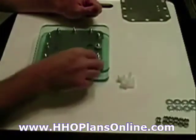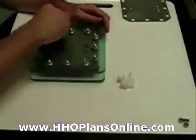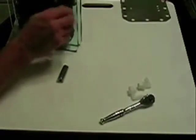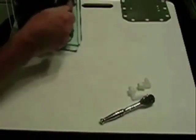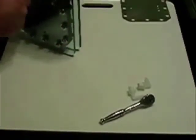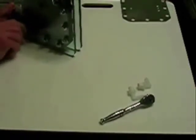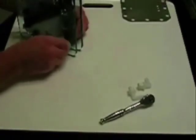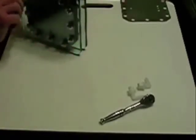Come back and put washers — you can use lock washers, but I'm using small fender washers for now. When you are torquing these — I'm just doing it hand tight right now — make sure you do it in a star pattern, like you would if you were changing a tire or putting a wheel back on a car.